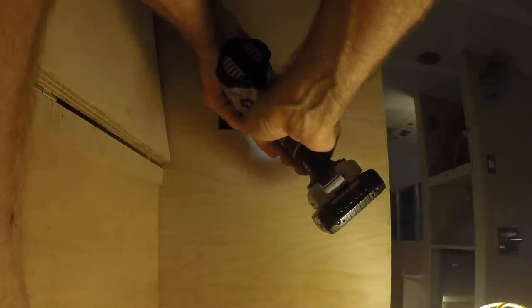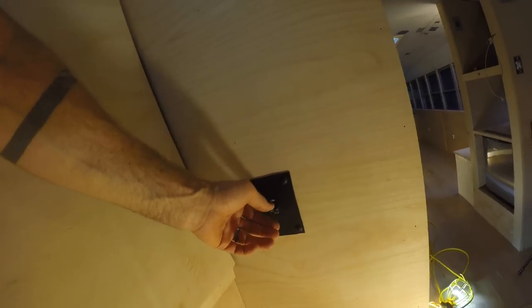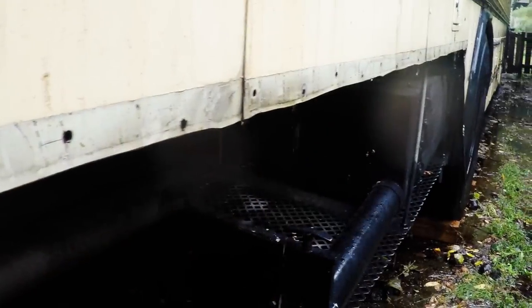This is the new 12 volt switch back there, and I just got a steel one, and it'll have a rubber gasket on the top like the other one, and it'll work pretty well. Those lights now are running. So in the back area, similarly, there's 12 volt lights and 110 shore power lights. So kind of like two systems everywhere you go.